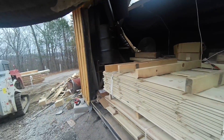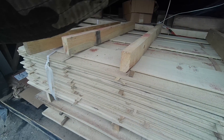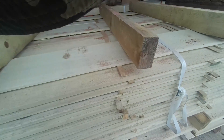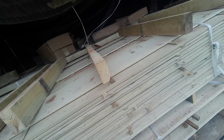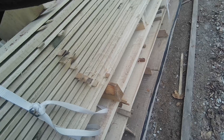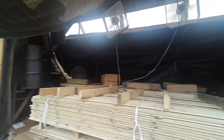This is actually completely dry — it's been in our kiln for 30 days now. I've already checked this and gone around, but I've been in and out of here. The wettest beam I could find is reading 11.5%, and this one is 10.2%. Everything else is reading under 10%. Right here at the bottom in the middle — low, reading 11%.